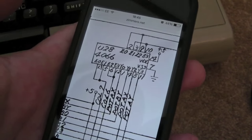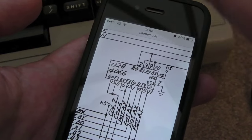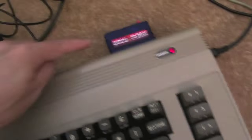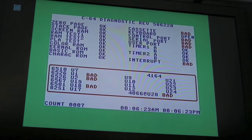I've measured and checked what I can — I can't see anything wrong with that component, but it's still on the board. I've not socketed it yet, but that's my next port of call. Before I did that, I thought I'd flash my EasyFlash cart, put the diagnostics on there, and see if it comes up with any failed chips. I was expecting a RAM failure, if I'm completely honest, despite just seeing that 4066.